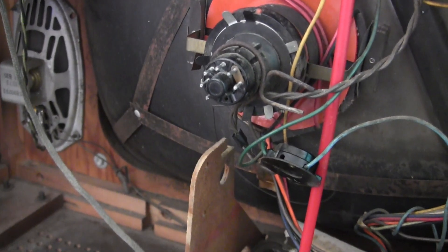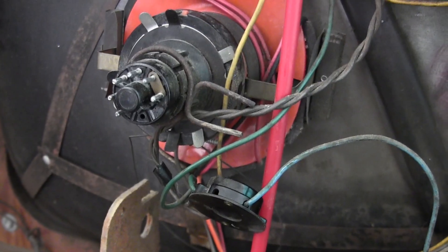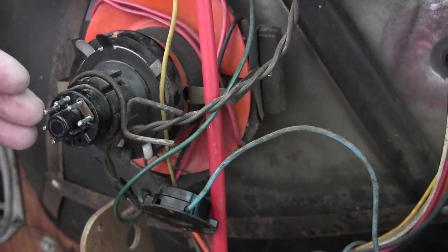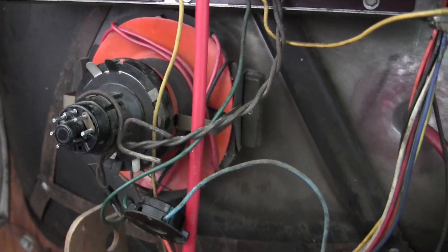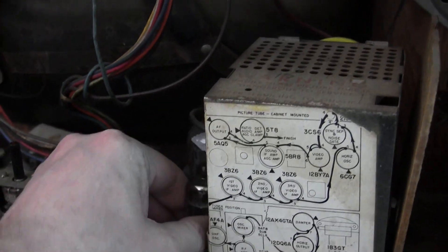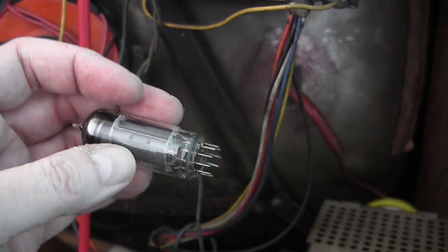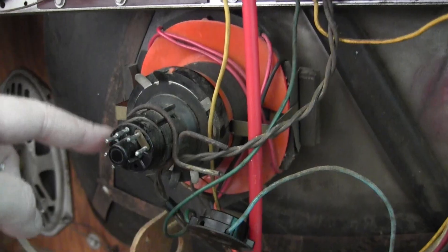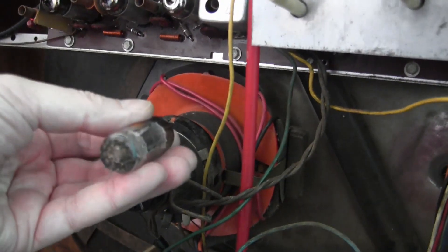That's what the base looks like, which might not be familiar because they didn't use it for very long — about two years max. It's seven pins but they're beefy. By switching to pins that come straight out of the glass — which I think was a bit of a technological innovation — manufacturing and material costs were really reduced. But picture tubes up until this point always had this Bakelite base with the leads coming through and soldered onto it. Just after these came out, they switched to the new style.